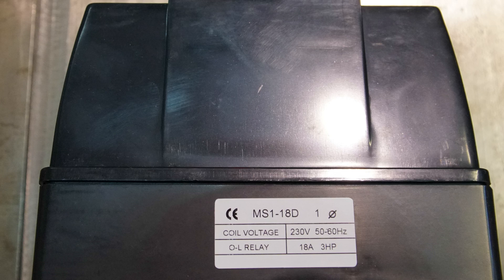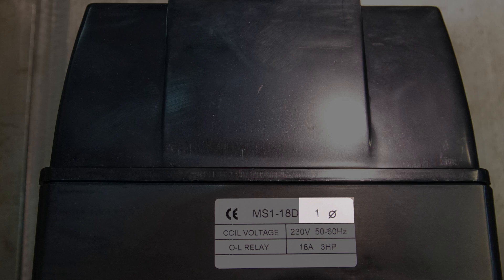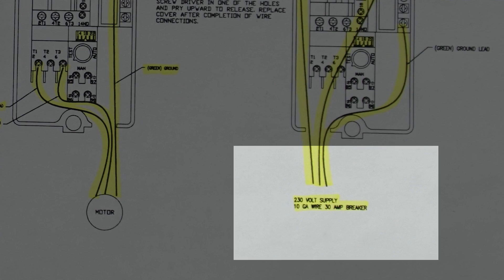We'll use two different diagrams — one for the switch and one for the motor. For this conversion, I'll need a switch for a 3-horsepower single phase motor. You can see here that this switch is single phase and here that it's 3-horsepower. For wiring instructions, find the switch wiring diagram in your user manual. If you don't have a user manual, we posted one for the PM66 in the links below this video. At the back of the manual, you'll find the appropriate diagram for your motor — in my case, the 3-horsepower single phase diagram. Follow the diagram to know which wires go where; it will also point out what gauge wiring you should be using.